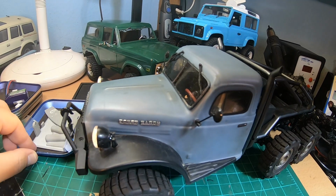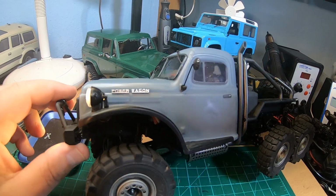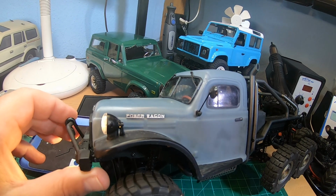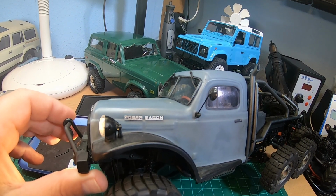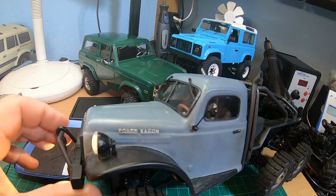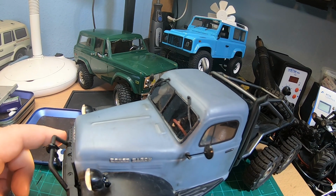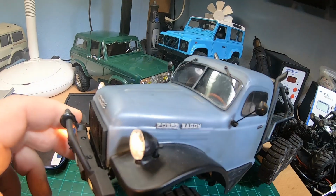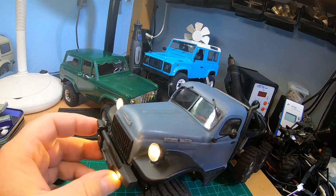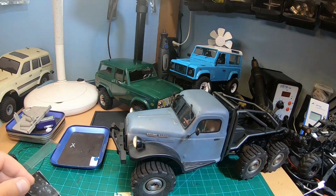Yeah, and the logos were quite a lot of work. I played around for days with my printer and always tried to make new ones. They are far from perfect, so I do have a normal printer and I am really not good in 3D constructing and printing. I'm a total noob. I used a 0.2 millimeter nozzle and made a lot of tries. Again, I tried to make the letters 0.4 millimeter wide, so 0.2 by 2. However, this was probably even more work than doing the window, and the result is, if you take a closer look, you would say it's bad, but from far away it looks okay.